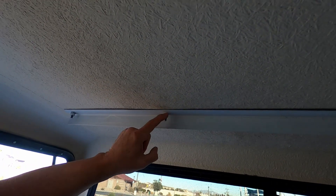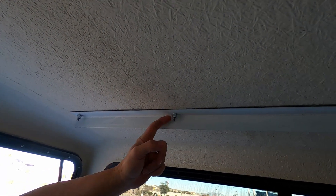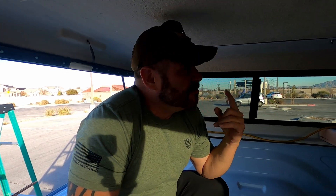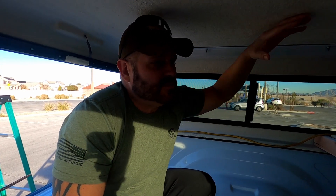I drilled all the way through my angle iron and all the way through the roof with a quarter-inch bolt, and I used a lock washer. If you're thinking about doing it this way, I'd suggest working from the inside. It was easier for me to work inside using a framing square, double and triple checking all my measurements to get everything as square as possible. Not that many people will be looking at it from the air, but I wanted the angle iron square.